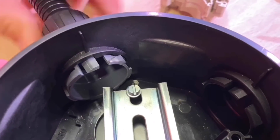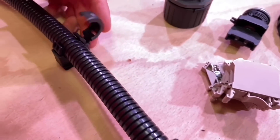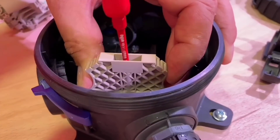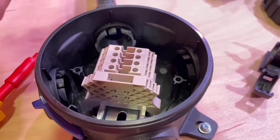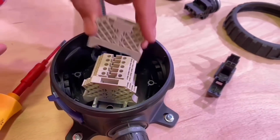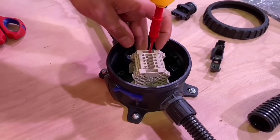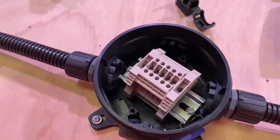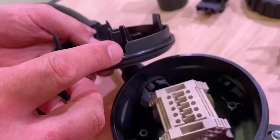This box is almost like a combination between a regular enclosure and a conduit box. The internal diameter we've got to work in is 110mm, so there's plenty of room. I've used that space to put in some DIN rail terminals. Put the end blocks on — a lot of people forget those to stop them sliding apart. There you go: a five-way DIN rail terminal block installed inside.